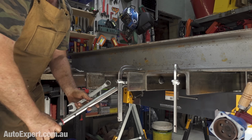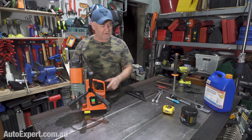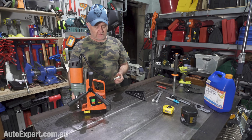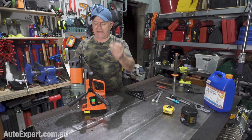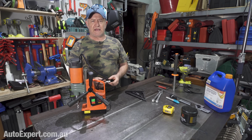So that's brilliant. Now, just another couple of quick points about the mag drill. When you buy this one, not only does it come with a full set of cutters, it also comes with a standard drill chuck, like for a twist drill. It's got a Weldon arbor on the blunt end of the chuck. So this is a Weldon shank. It's got these two flats. The flats engage with these two grub screws here. You just crank them down with the right Allen key.